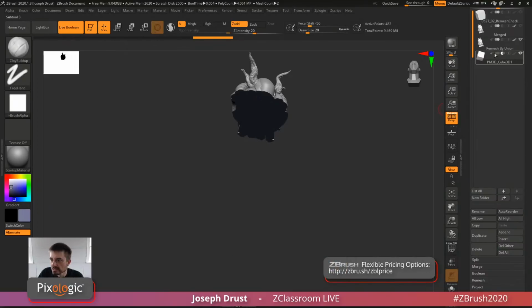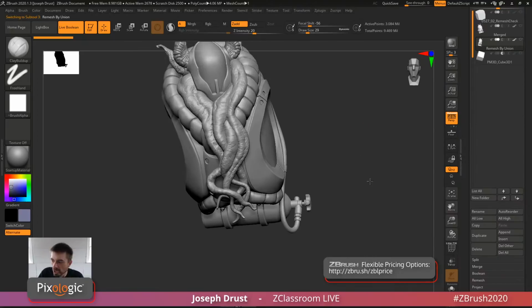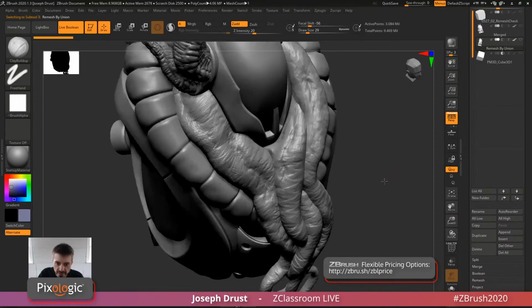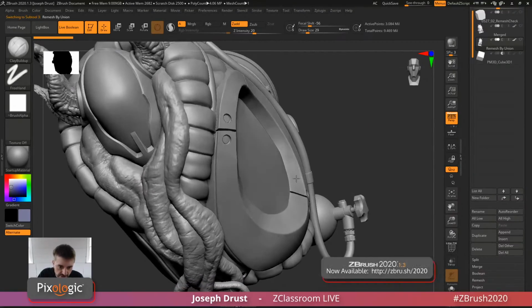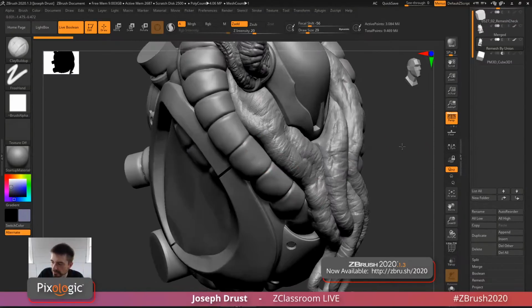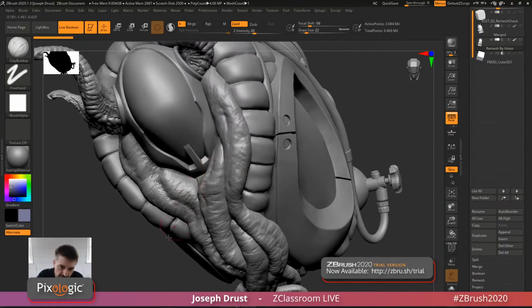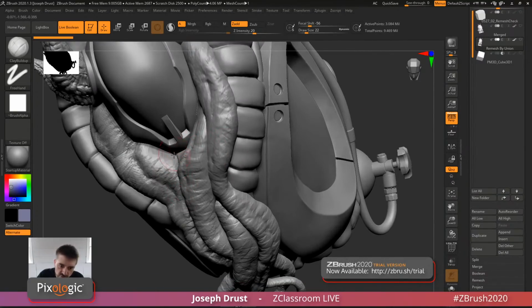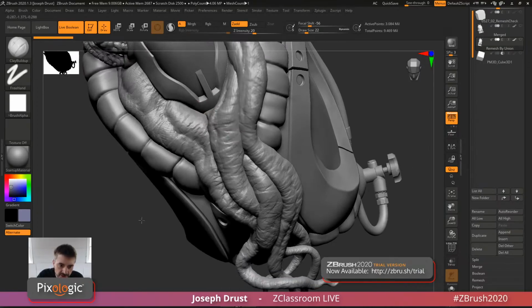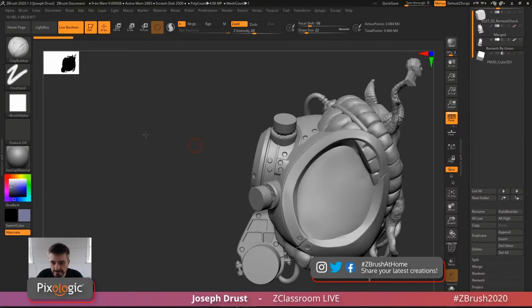So this is another thing you need to look out for when you're modeling, especially for 3D printing. If I look at this mesh, all this stuff looks pretty solid. The remesh by union looks like it solidified all this stuff out. However, there's this one hole right here. This little tiny hole, where these two pieces of geometry don't fully intersect, is creating a pocket in my model.